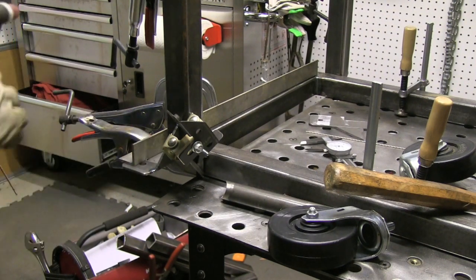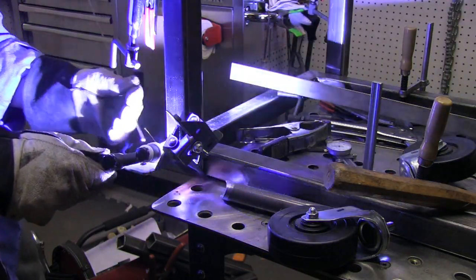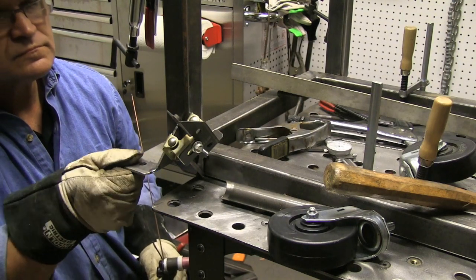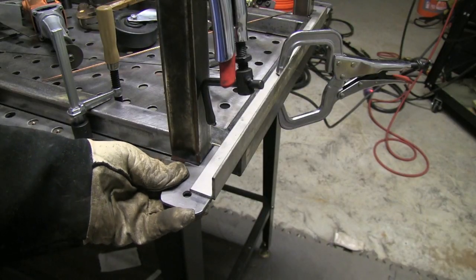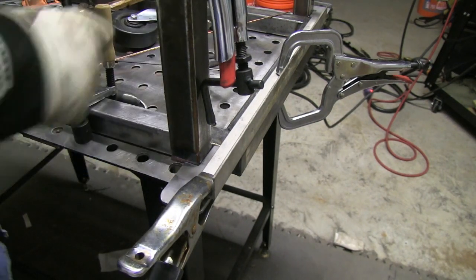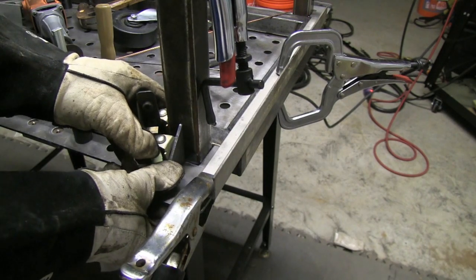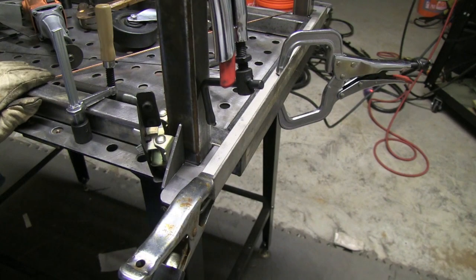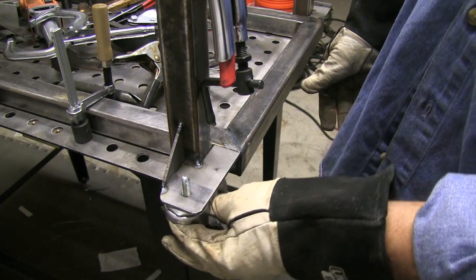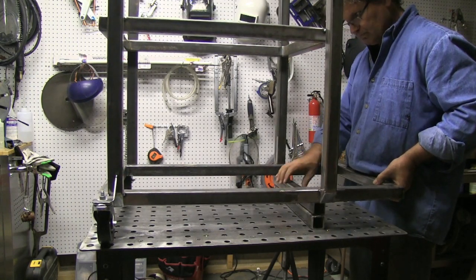That's a Strong Hand Tools mag tab I put that little gusset on with. I've held pieces with my fingers for years and burnt my fingertips, so for what it costs — 13 or 14 dollars — it's a handy little gadget. On the other side, I've got a piece of angle iron clamped to maintain the flat surface so the top of the bracket is flush with the top of the bottom platform. The mag tab gets the gusset lined up for tacks. I then check wheel clearance at the mitered edge — it just barely clears, which is exactly what I want so it doesn't catch things around the shop.